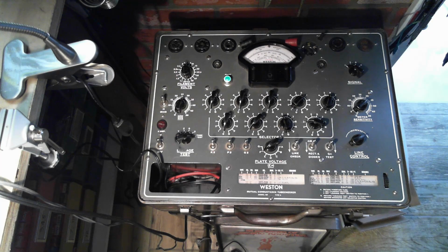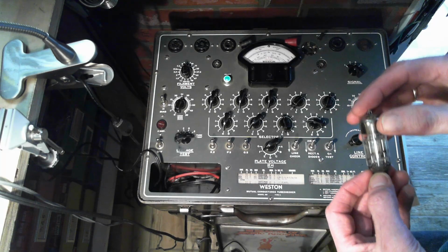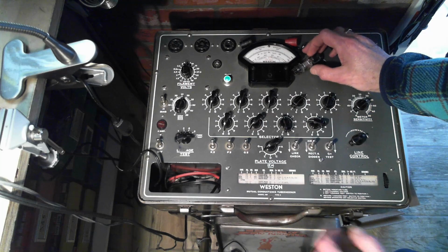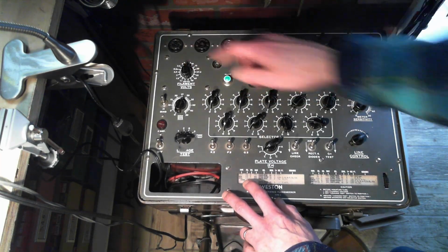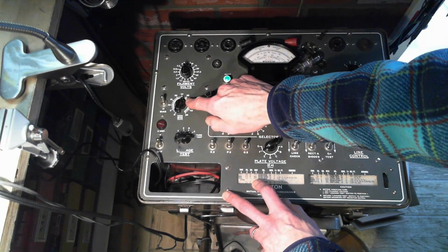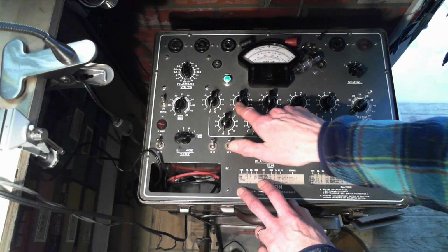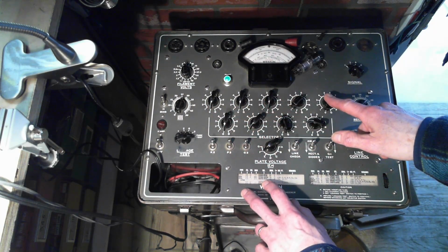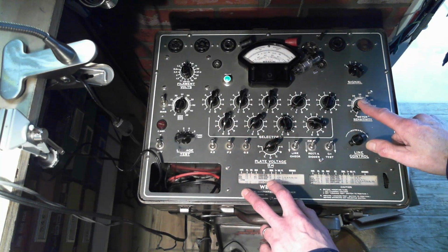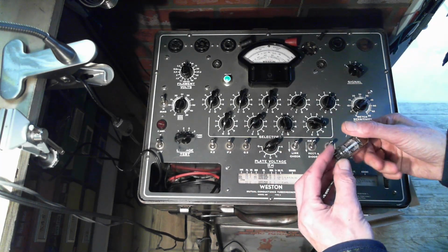Okay, I've got the EABC80, which is a slightly updated version of a 6T8. This guy's got 6T8 listed, so I've dialed in 6T8. Let's just double check. 6.3 volts on the heater, 1 for the signal level, 27 L for the bias, 00076, 0153, 33 on the cheater, F. Okay, here we go.